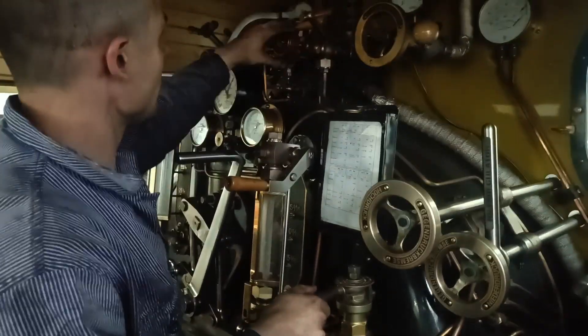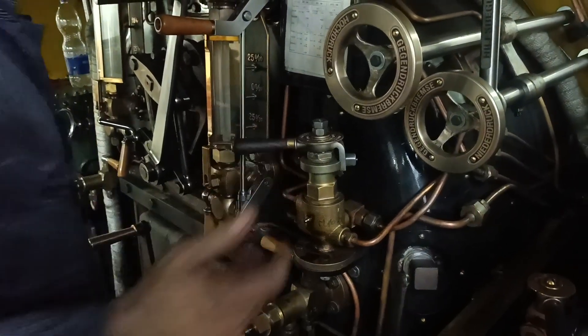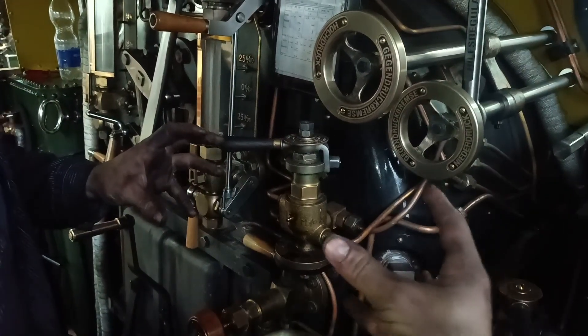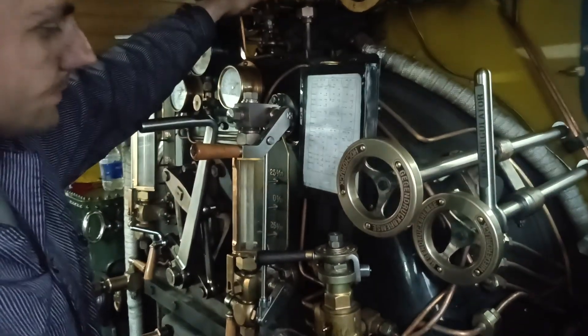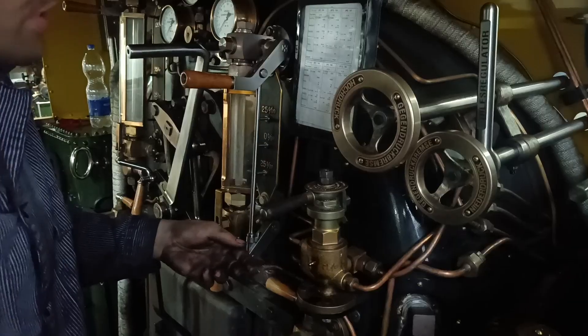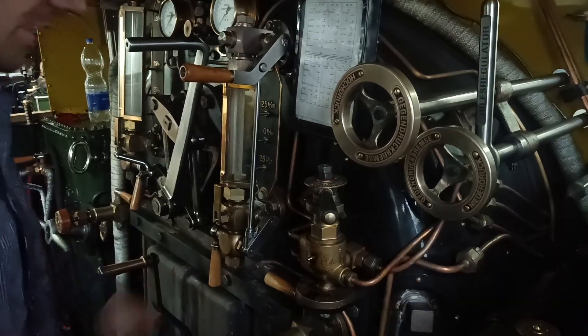About 60% of the pulling force in the rack comes from the LP and 40% from the HP. You can think of the control valve like a momentary switch — it'll look to a lot of English speakers like a brake stand. Here's our live steam from the boiler; it's just saturated. That servo piston is double-acting. If we want to go to adhesion and cut out the low-pressure cylinders entirely, we put it there, and it'll start to move — steam from the boiler going into one end of the cylinder while the other end exhausts to atmosphere. There are also little purge valves on the cylinder itself. Once fully moved over, in the center nothing goes anywhere. We then switch it: live steam into the opposite end and exhaust to atmosphere out of the original end.